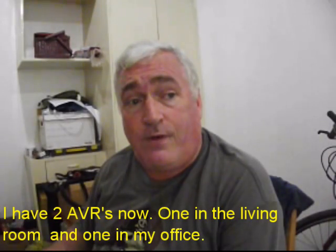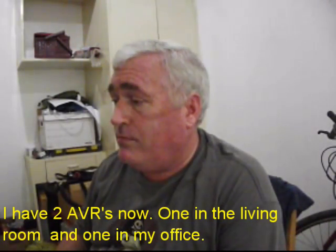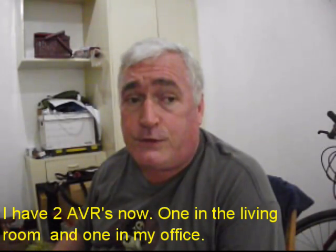That's when somebody told me to get an automatic voltage regulator. It's supposed to help smooth out power fluctuations. But here we just put a meter in the outlet and you'll watch it just bounce back and forth. When we say it's 220, it's actually 190, 250, whatever — it bounces around a lot.